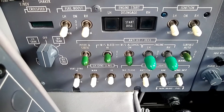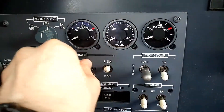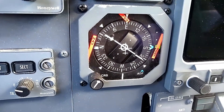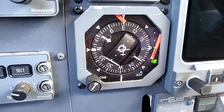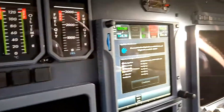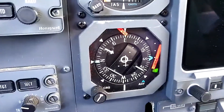Now let me show you, when we turn the E-merbus on, how we verify all of that. When I turn the E-merbus power on, we see that the battery voltage comes up to 24 volts. Let's take a look over here right away at the HSI — we see the various flags getting pulled. This is connected to NAV1, so because the Garmin GTN 750 is our NAV1, that's running through some checks, which is why we're going to see different indications here.